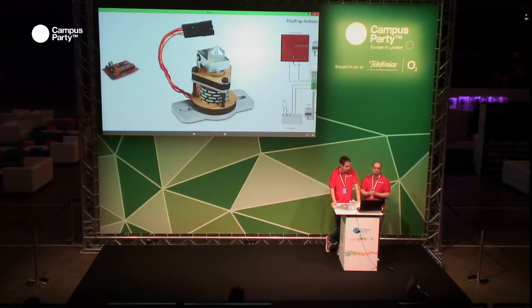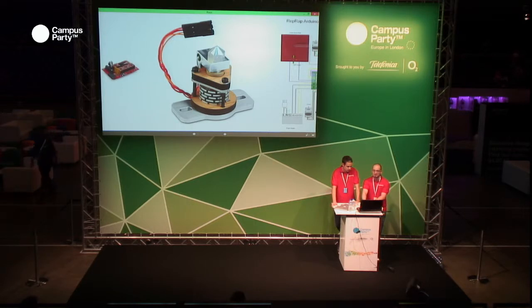This one is the most important piece of the 3D printer because it is the hot end. The plastic is pushed into the hot end to be melted, and then from this hole the plastic is laid onto the bed, making layers from the bottom to the top. And this hot end is called Budaschnozzle, and you can change this nozzle. So if there are several sizes, you can print with the size you want.